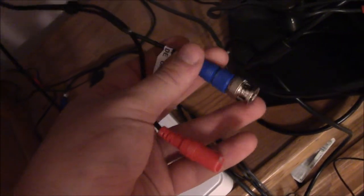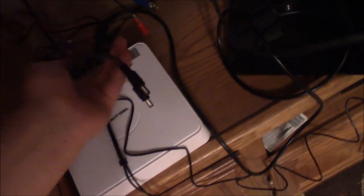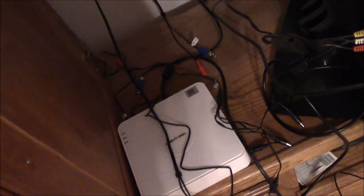So what we've done here is we have our plug strip and we have two AC to DC converters. We have one that goes to the actual Night Owl DVR box and then we have the other one that comes out here — this is going to be the power for your cameras. So whenever you have your camera wires, you're going to have this connector for the actual video part, and this is the one that's going to supply power. The power comes straight from it because there's two DCs. This one has a splitter that splits into four and you have one for each camera. So it's pretty straightforward. What we're going to do now is hook it all up and press everything off.